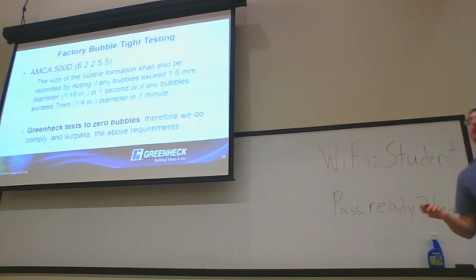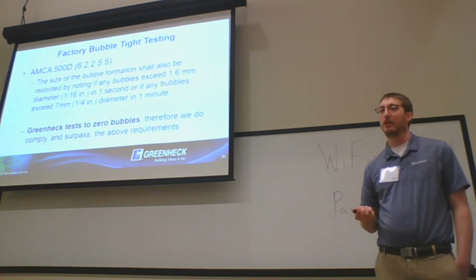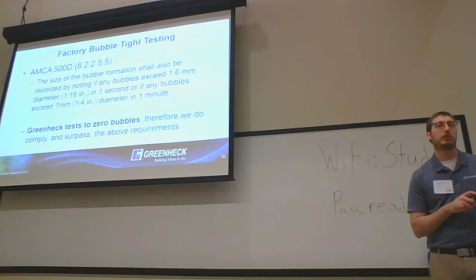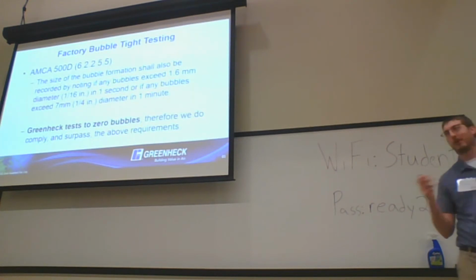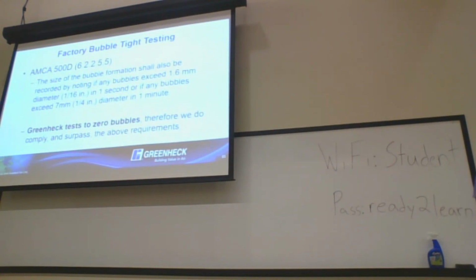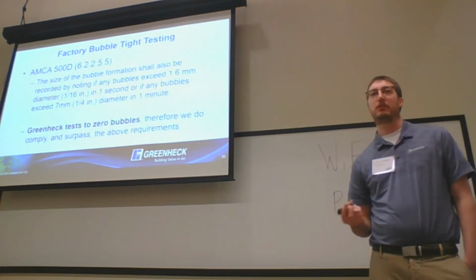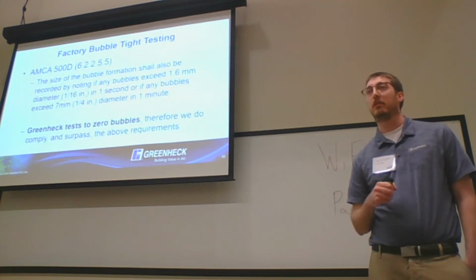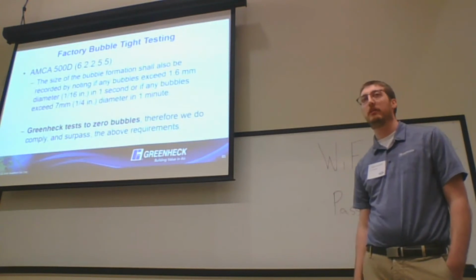So like I said, on the heavy duty side of things, we're going to see a lot more special design. Temperature is a big one we see for special design on heavy duty stuff. So higher temperatures, think of around here, paper mill applications we see a lot for high temp and different types of materials. So if you have silicone free, for example, or it has to be 316L stainless for a hospital application, that's where we'd see a lot of that come into play.